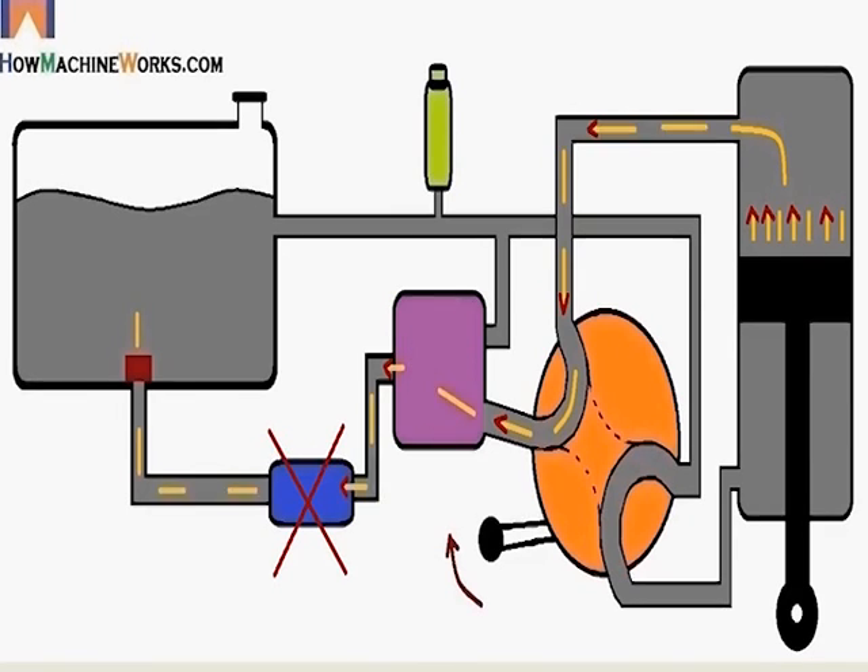This condition — hydraulic pump damage — only happens when the main relief valve doesn't function. The main relief valve is set at 200 bar. When pressure above 200 bar occurs, the main relief valve acts and reroutes the oil into the return line, so it does not allow the oil to go toward the hydraulic pump and damage it. The oil gets filtered and returns to the hydraulic tank. That's how a main relief valve protects the hydraulic pump.